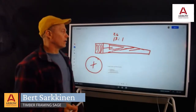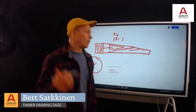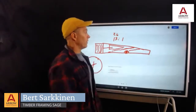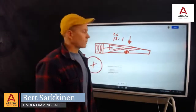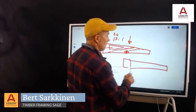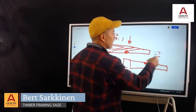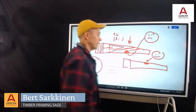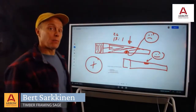And then a knot in the wrong place. The wrong place is a big knot that's by an edge. And if it's on the bottom, why is that important? If this beam was here, and that knot is right here, this one is a happy face, this one is a sad face. Why? It has to do with tension and compression.